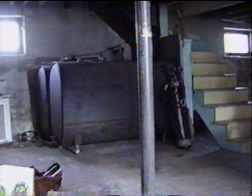All right, you've got a little bit of soot dripping down here, probably because there's no cap on your chimney. I'm going to guess, based on what I saw when I was up on the roof, that the larger side of the chimney has two flues. There's a flue pipe this big on this side, and a smaller one on this side, facing the house. Normally the bigger one, the 8-inch by 12-inch, is usually for a fireplace, so that's why I mentioned fireplace. Now that I'm looking at this, the old house would have had a huge boiler in here, which would have required a bigger flue, so the left side, the bigger one, is actually this chimney.